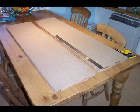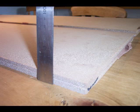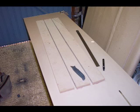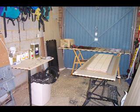So get your sheets of foam. This is Divinycell. I've got 4 sheets of 10mm Divinycell here, sort of medium density foam that you'd build a boat hull from. I've stuck both pairs together with a mixture of bog, and then I'm drawing my profile on the foil. I'm going to split the foil down its length, as you can see here, to put carbon stringers through the foam to give it more structure. I'm doing that because I'm not using high density foam.